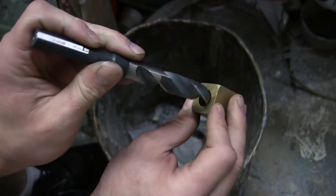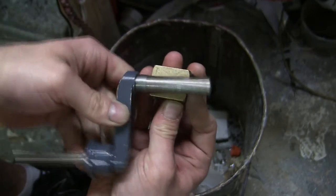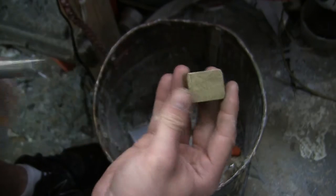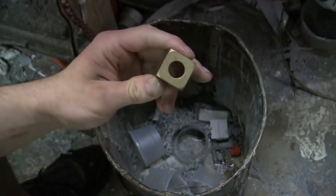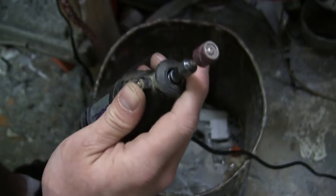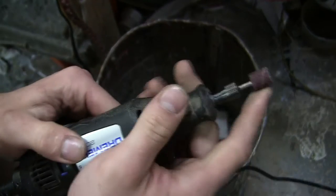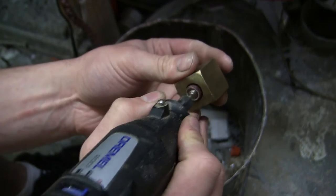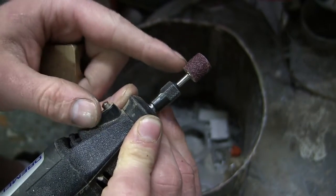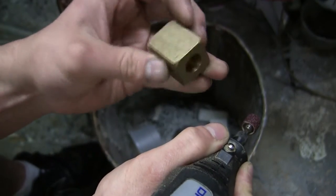So if you try to drill this out with a standard drill bit, the hole will be too large and the swing arm, once installed, will have a tendency to have some play. If this component has any wiggle or play in it, it will be very detrimental to the tank's performance and basically your suspension will be terminal. In order to open up the tolerances, I found it best to utilize a small diameter sanding drum. The standard drum size is going to be too large and will not fit the diameter of the bushing. This midsize version, as you can see, fits in absolutely perfectly. For the drum itself, I use the coarse version — avoid the fine grit as it will be quickly worn out.